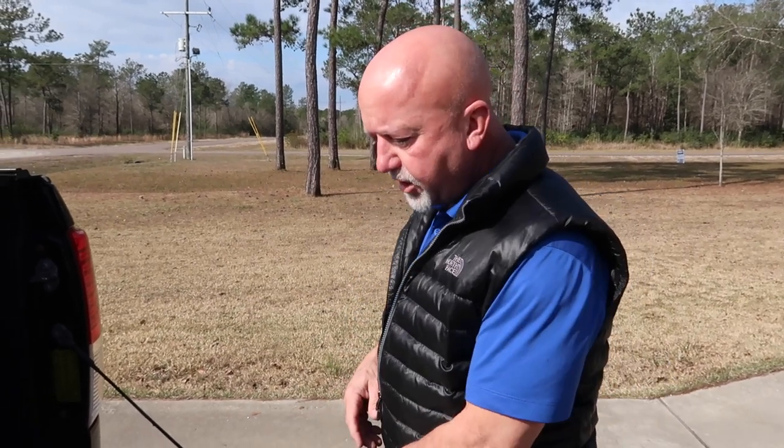Sometimes when we send this probe through, it goes straight through the OSB board. You also want to know what type of substrate it is. If this goes straight through the OSB board, that means it's been wet a lot and that it's compromised. We recommend the stucco be removed in that area until there's no more compromised wood or rot, and then they put it back together. So what we'll do is head off and start drilling a house.